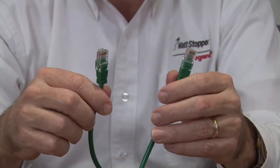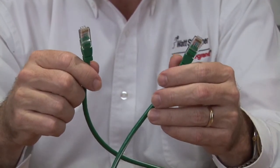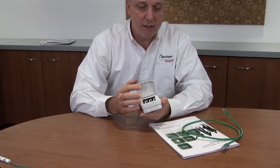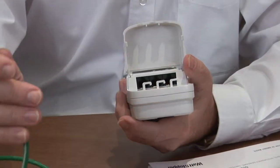Instead of taking a simple approach, we wanted to take advantage of the digital communications that are available today. Part of the architecture of Digital Lighting Management is the RJ45 patch cord, and these will be available through the Alps Controls e-catalog. The cornerstone of the product, similar to the power pack, is a digital power pack, and this has three RJ ports available to just plug these devices in. This room network communicates over the RJ45 network.